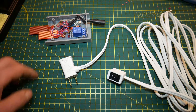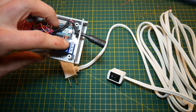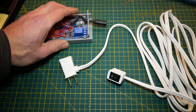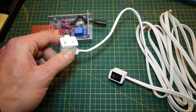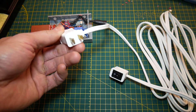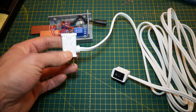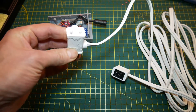One end of the tap wire should be connected to the COM terminal on the relay, and the other end is connected to the NO terminal, which stands for normally open — meaning the circuit is normally off. You may also notice this cord has a two-prong plug, not a three-prong plug. I'd recommend finding a three-prong extension cord to cut into so you don't lose the added safety of the third ground prong, especially since this is going to be in service around water. Please use common sense: when you cut into your extension cord, make sure it's not plugged into any wall receptacle.